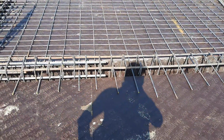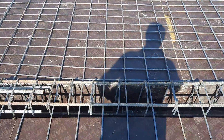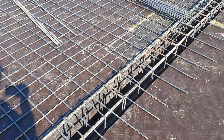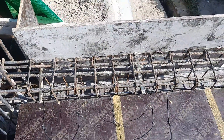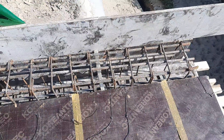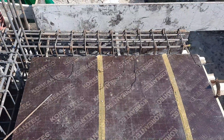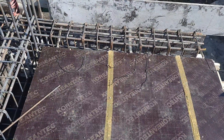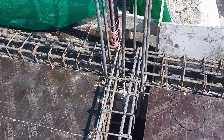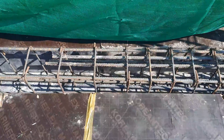You can see in this simply supported beam they used extra steel rods. They should also provide extra steel rods in the cantilever beam because that is very important, especially since on top of the cantilever beam we are providing a cantilever slab. Therefore, it's important to do the proper steel structure design. You can see the shuttering on top — they will provide steel reinforcement with a spacing of four by four inches. This is floor beam construction and they used 60-grade steel rods.